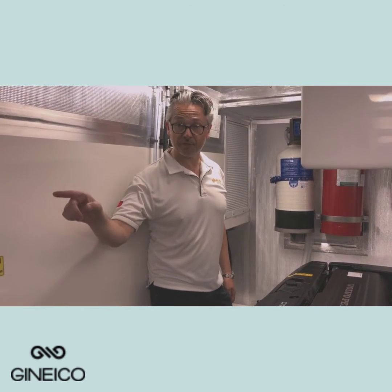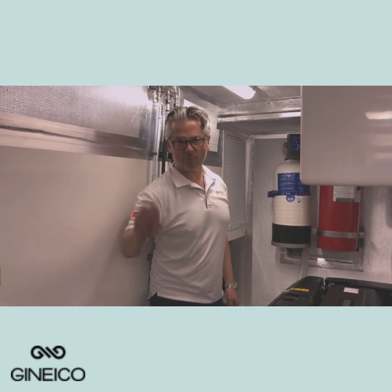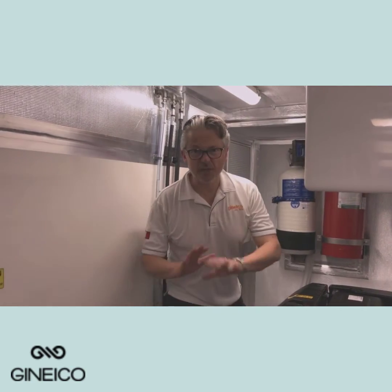You set the lever down to flush and turn that knob on again for 15 minutes. Then you turn that knob off again, switch off the low pressure pump, set the handle to rinse, turn that black dial back on again and rinse for five minutes. When that's finished you turn that off again, put the handle back to production and your machine is ready to go.